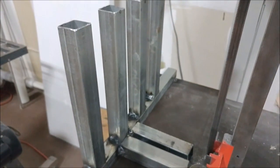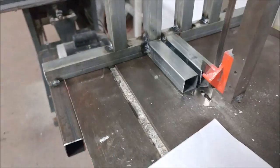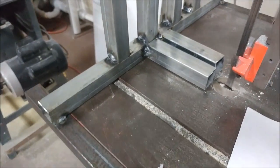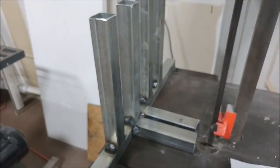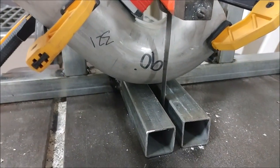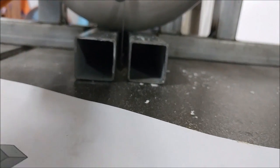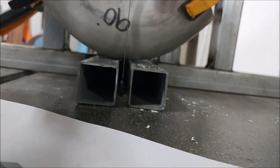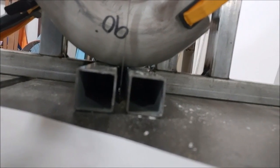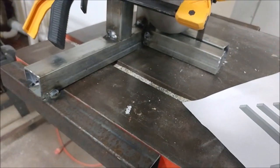I created this fixture and just rolled it up and added some scrap steel we had laying out the back. The idea is that it slides along the table while holding the pipe in place, and then we get a nice accurate cut. You can set the angle using the level and then just push it along and it will cut right at the right point.